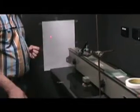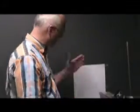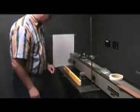This experiment depends on the optical bench being pretty flat and also the wall that the paper is on being at 90 degrees to the bench. Here I've got a yellow spirit level — we put it down on there and we can see the optical bench is nice and horizontal. And on the wall, the bubble is in the middle, so that's good.